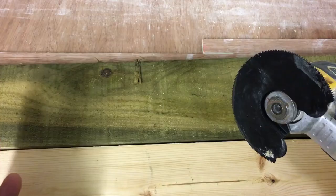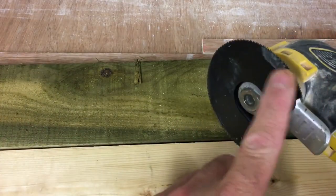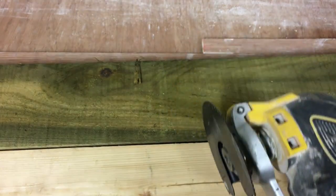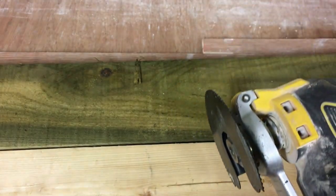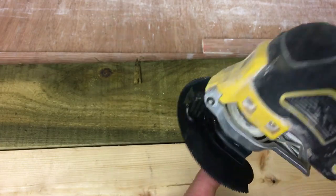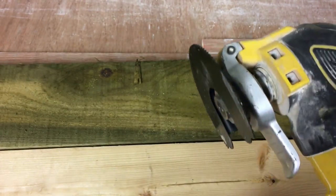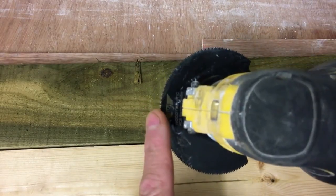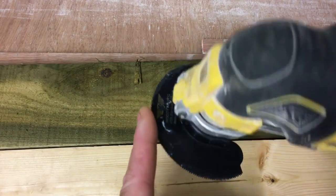Okay, there's another use that's really common for me anyway, those terrible thin bath panels, you know, the cheap plastic bath panels. They never fit those things, so this particular blade here is great for cutting those. So you just run it up the, you know, really thin plastic, really thin and flimsy, but these blades are so accurate if you just take your time. You can just cut some intricate shapes. So this is the bath panel blade in my opinion for me.